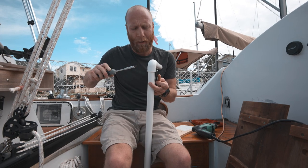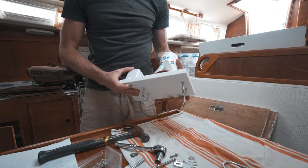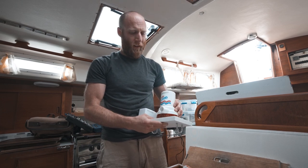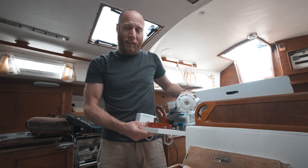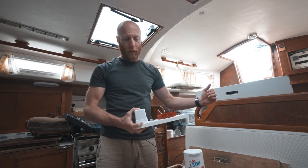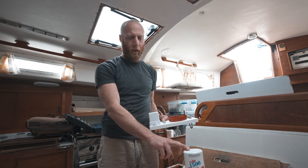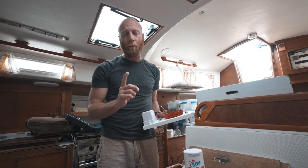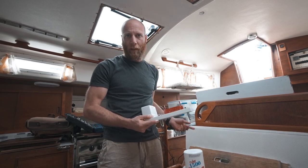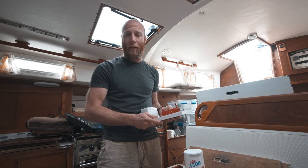I've got the PVC glue on here, but a little extra reinforcement probably can't hurt. Here we have the finished product. Because of our extremely limited access, this is going to have to be assembled in the bilge, which is not going to be easy or fun, but it's kind of the only way. I'm going to slide this in, try and slide the PVC into this, crank down on the locking nuts, and last we'll fit the bilge pump onto the base. I've already checked that it'll fit in there. It's going to be pretty much impossible to film, so I'm going to go ahead and do this and get the camera back on once it's down there.